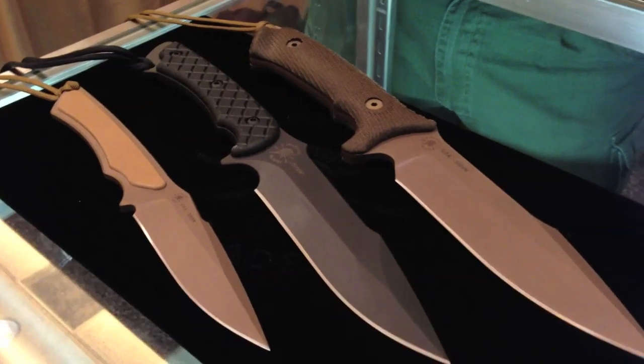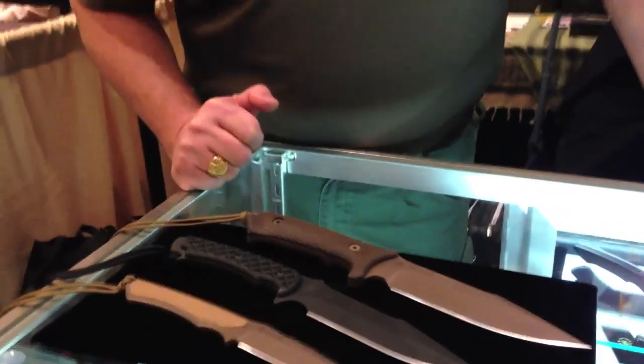We do have some rules at Spartan Blades. One of the rules is all our knives are sharp and pointy. It sounds like a joke, but it's amazing — especially for a lot of folks out there in the knife world who've picked up knives that haven't been sharp and haven't done what you want. It actually is quite serious. To that point, we only use S35VN steel from Crucible. Many of you might be familiar with S30V. S35VN is based on the S30V design of steel, with some improvements — the biggest being the removal of some vanadium and the addition of about half a percent of niobium. What that does is give us additional toughness, not necessarily better edge retention, but it allows us to take a better cutting angle on a blade while still getting the same wear resistance, toughness, and edge retention.